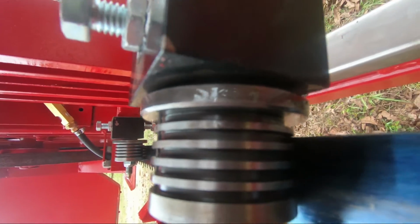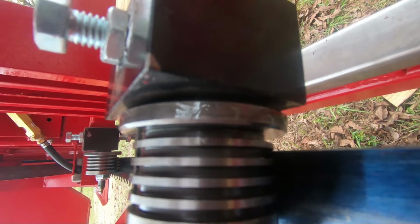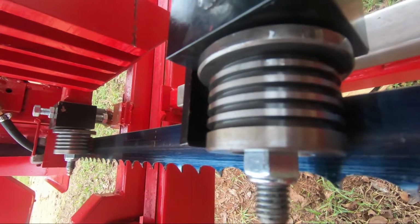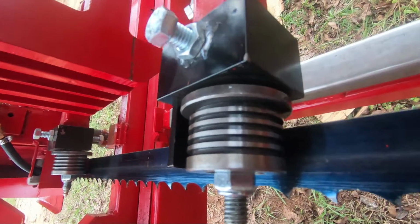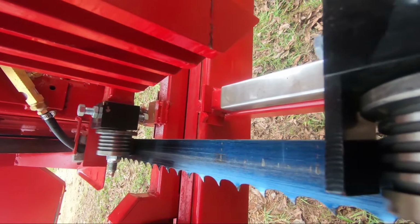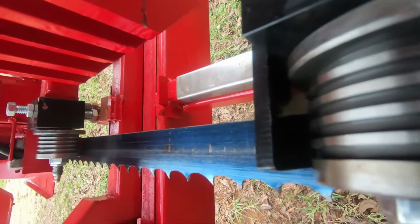Touching the flange will cause the back of that blade to work harden. It will make it brittle, and will cause them to break. So I cannot have it riding back there, but if I have it running too far off, we run about a 1/4 inch down pressure, and if that guide's pushing on the back side of that blade, it will flip it up and cause those blades to rise. So we're looking for the last rib to the back flange. That's where we want to set our alignment.